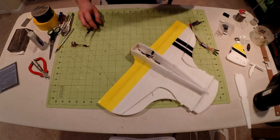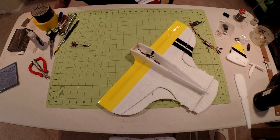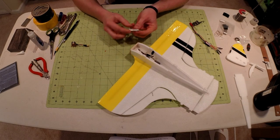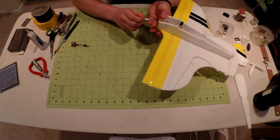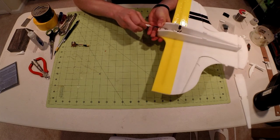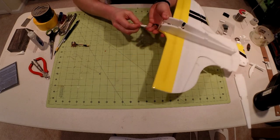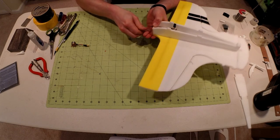And probably going to use just a small drill just to get those holes started, so when we're threading the screws in, it's not too difficult. So this is a little tiny pin vise that we have, that for tasks like this works a lot better than your big electric drill. You have a lot more control. So we're just going to take our firewall where the holes that we marked were and just drill the hole. Just get it started. Want to give those little screws all the help they can get.